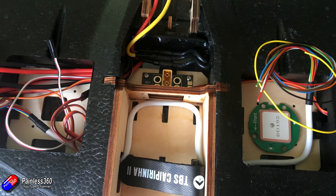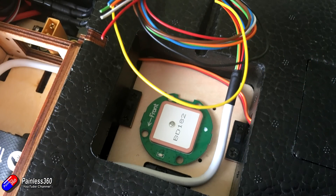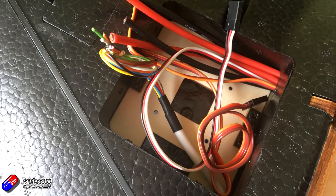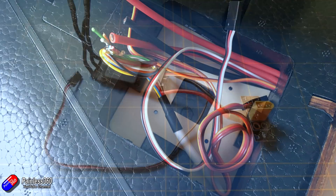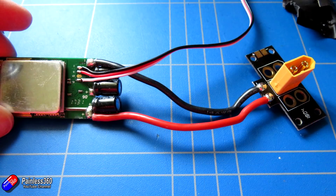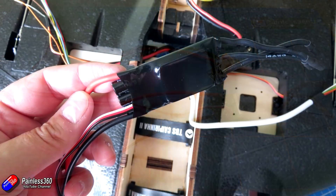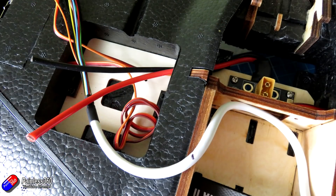The first thing I did was install the cable, leaving myself with a lot of wire at each end so I could trim them back. The GPS was going to go on one side — I used a little heat shrink at the end of the cable to tidy it up. On the other side you can see the other end of that multi-core cable, the two servo connections, the power leads in and out, and the ESC connection. For the power connection, I took out the ESC and power distribution board from the back of the wing — it comes out with four screws — removed the heat shrink, soldered on two new lengths of cable using the same cable sizes, then put heat shrink back over the ESC and XT60 connector and fed them back into position.